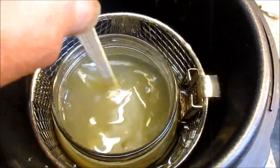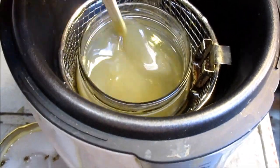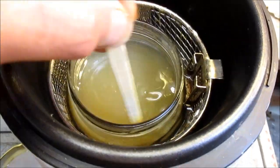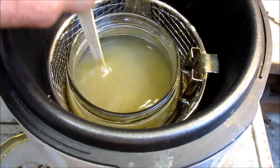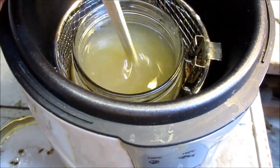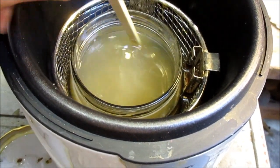The book suggested a 10% glue which is water thin, which I thought was probably a little thin for what I want, because he uses the very thin water-thin stuff for the original coating of materials - sizing or what have you - and then a thicker solution for the actual glue-up. So I thought I'd compromise, but when I mixed it up at 10% it didn't seem to want to gel and it just seemed too thin.